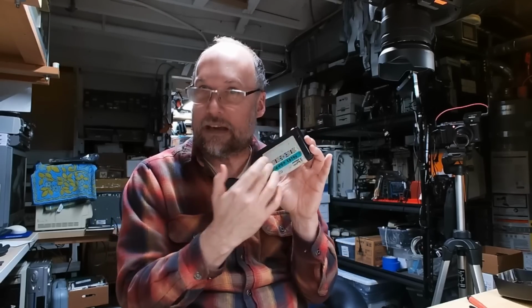I was doing some research last night on cartridges used on MSX1 machines. And much like on the Nintendo Entertainment System, the NES, there are mapper chips used inside of these to allow bank switching within the cartridge. So you have some games that are 256K, 512K in one of these cartridges, and it does that by bank switching inside of here. In my investigation though, there were a number of 32K ROM cartridges, and it seems that everyone says that is the simplest design for a cartridge.